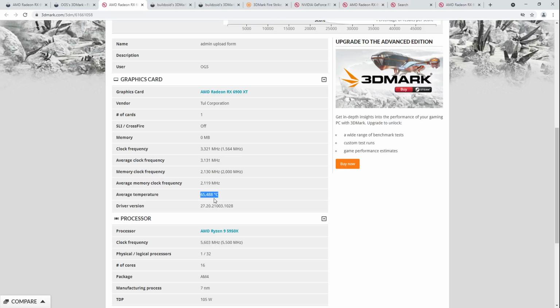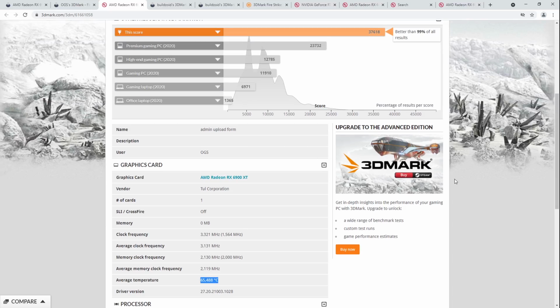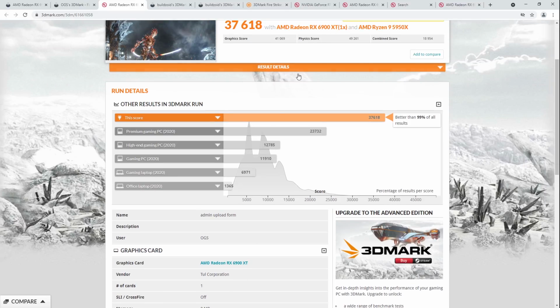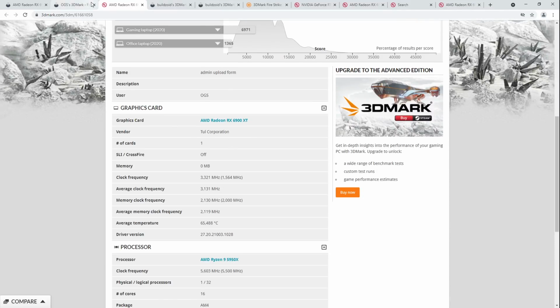It really makes me think AMD could probably patch this by just giving you a toggle to disable temperature monitoring. Honestly, that would probably work. Maybe there's some way to remove a component on the PCB to disable temperature monitoring, I don't know. I kind of doubt it. I would assume all the circuitry related to temperature sensing is internal to the chip, or at least that's my assumption. But I think AMD could probably patch that behavior. They could probably also put in a toggle for disabling the super aggressive idling. But right now, in the current state, the card is very annoying to run on liquid nitrogen.